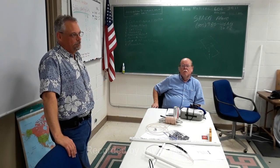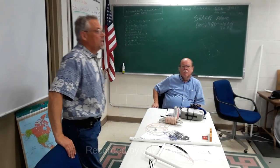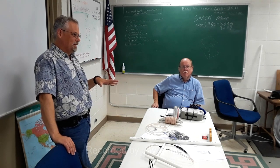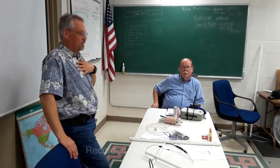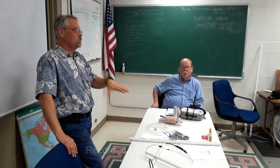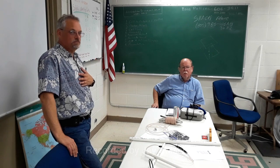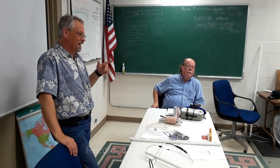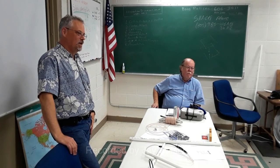Is that why we use a balun? Sorry? Is that why we use a balun? That is one of the reasons, and there's many reasons for baluns. Now, in my opinion, a common mode balun is a valuable tool to help reduce that. Look at the word itself, balance, unbalanced. That's what balun means. Going from balanced to unbalanced or back. But there's different kinds of balance. Yes, that makes it interesting. There's impedance conversion balance. All right.